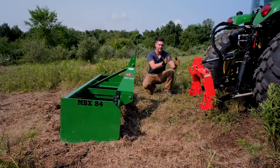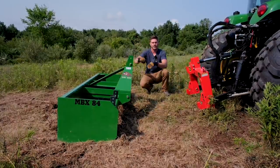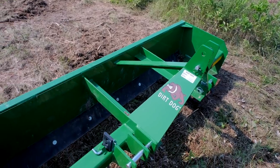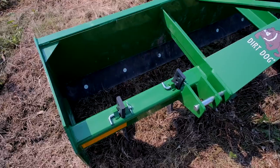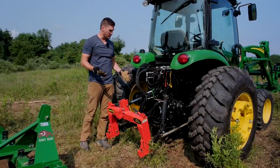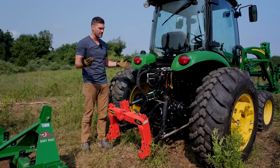As I was doing that — imagine the box blade's on here — the pile was starting to get taller. The box blade would kind of gradually climb taller and taller on the pile of dirt and debris. The only thing I can think of is that I somehow managed to let it climb too high, beyond the dynamics of the three-point hitch, where perhaps it went too high and maybe snapped something internally. That's the only hypothesis I have at this point. Chris and I have looked around and there's nothing visibly moving indicating some linkage is disconnected, so it's got to be internal as far as I know.